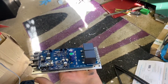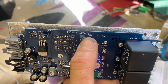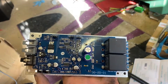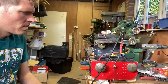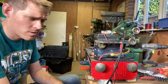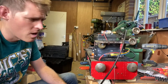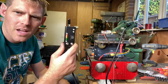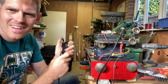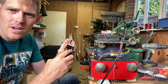So it wasn't working. I've opened it up and there's a link here that was set to 24 volt, so I've set it back to 12 volt. I'll put it back together and hopefully we'll have a bit more success. With a little bit of fiddling about I've changed the voltage to 12 volts — I had to take the box off, take the cover off, and there's a little connector that changed it to 12 volts. Turn the power on and we have power on the controller. Flick the switch and it'll go the other way.